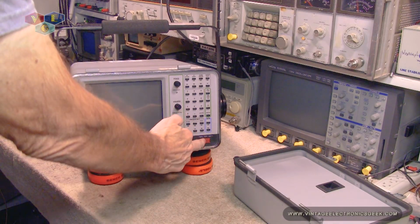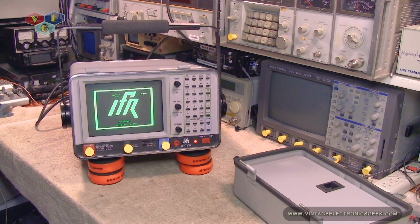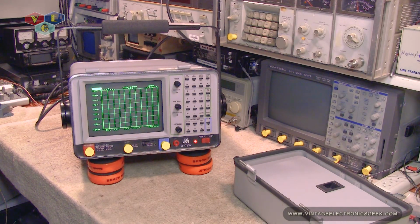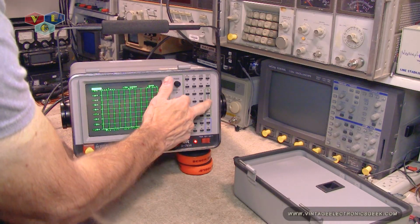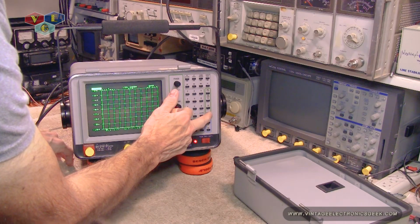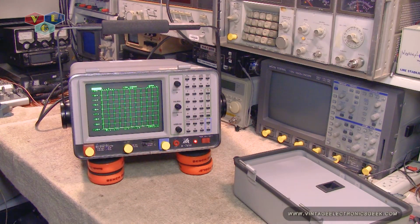One of the issues is when you power it on. The screen will come up, just as soon as I throw the big switch. I got this plugged into the isolation variac for your protection. Sometimes it acts like the keyboard may lock up or the CPU lock up. Other times not. What I mean by that is if I push my menu button or other instructional button, it may or may not come up. Like right there. Now this device has not been plugged in for about a month or so.